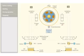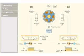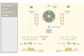The steering gear system you see is a rotary vane type electro-hydraulic steering gear. There are two sets of hydraulic power packs comprising hydraulic pumps and oil reservoir. The bidirectional control valve changes the direction of oil flow. Electrically operated automatic isolation valves isolate the defective system in case of emergency.